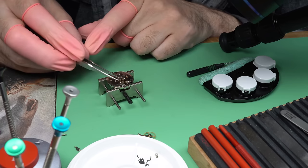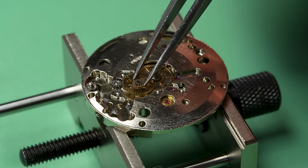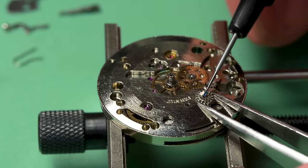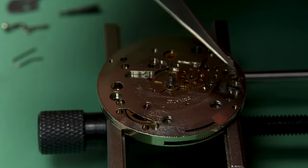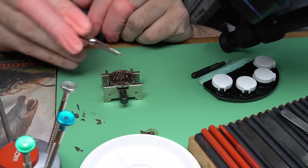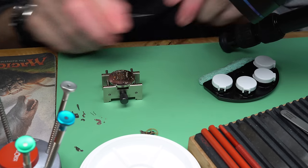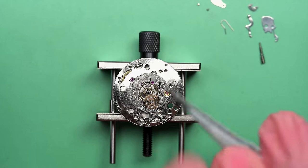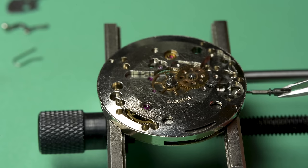A little bit of HP 1300 as well. The three main oils I use are light, medium, and heavy. The light is the Mobius 9010, the medium is HP 1300, and then the blue grease is the heaviest — Mobius 9501 grease. We actually have an oiling kit as an add-on at SutcliffeHanson — I put together the oils I use here plus another one, plus oilers and a little cup. Those oils will get you through most restorations. There are a few specialty oils you can buy in addition, but for a kit like that, that's all you need.